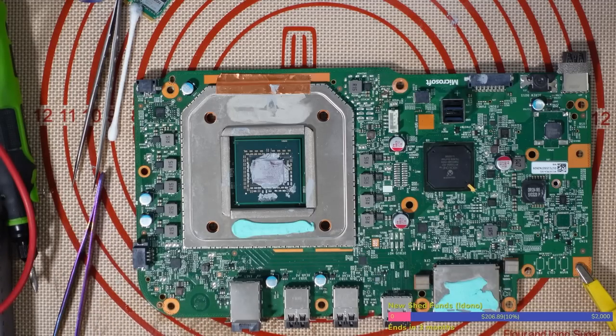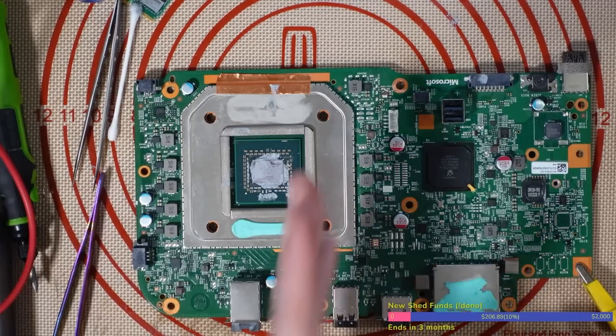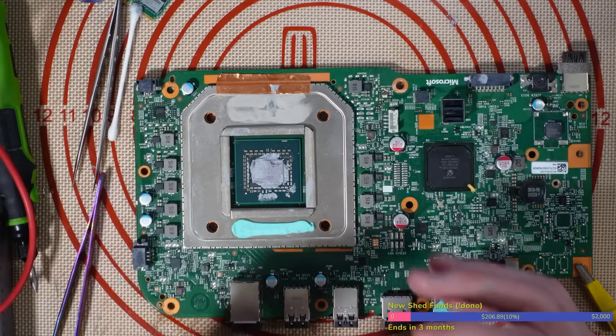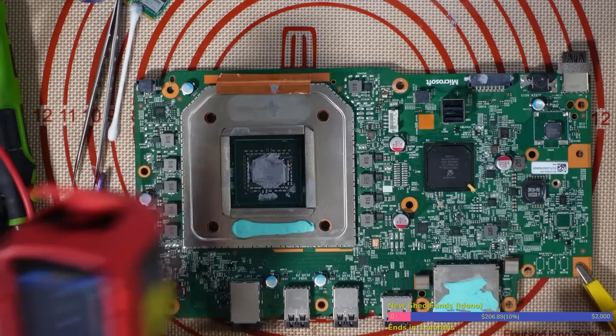Google Maps basically redirects it — this is a faster route, take this one. So we'll inject 1 volt and because it will take the path with the least resistance, it'll go through the shorting component, which is going to get hot. I'm going to use the thermal camera. I've got my bench supply set to 1 volt and 5 amps of current.